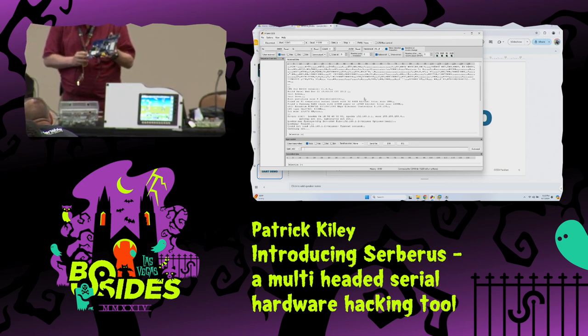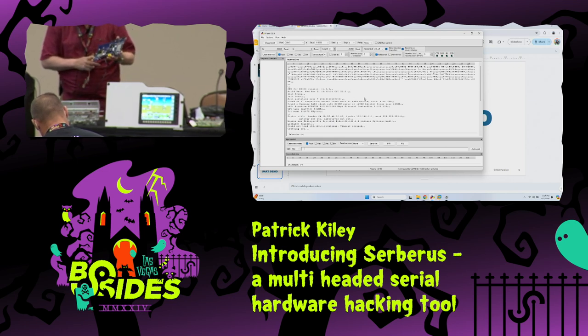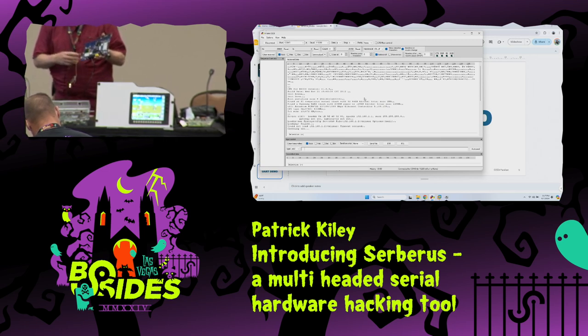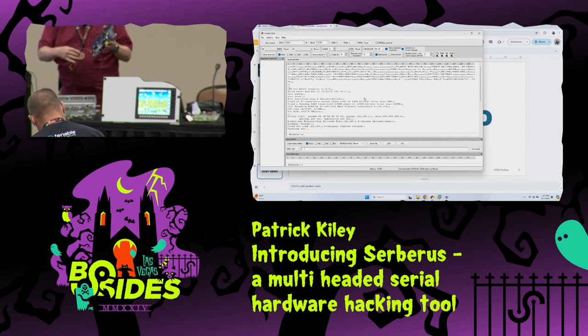99% chance you're going to have some type of pin header that looks like this on there. And all you have to do is either solder on the pin header or just connect to it if you don't have it. You can use a little $20 Amazon logic analyzer to verify which one's the transmit pin, and you'll be able to see the device boot. That shows well enough up on the screen. And that's just to show, you know, very simple connectivity.